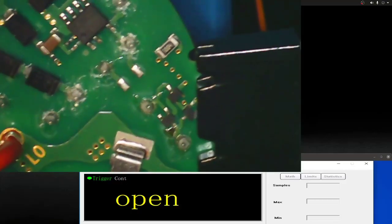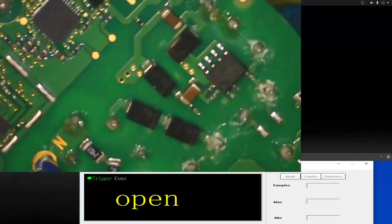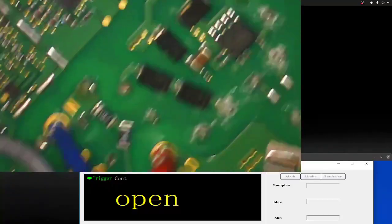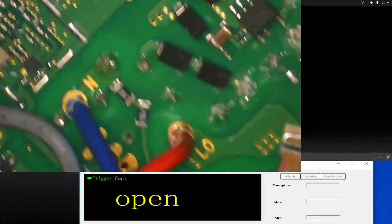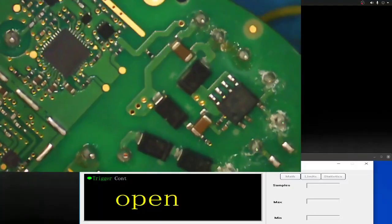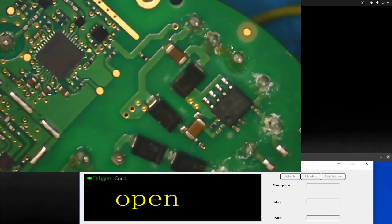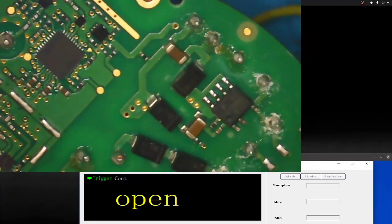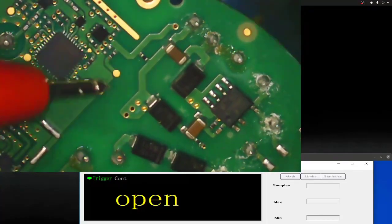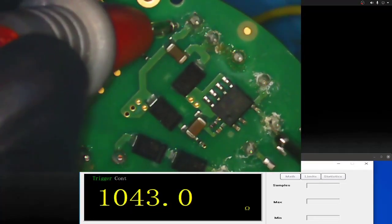Now I'm just going to see if I can, within the shot, get over to the... I can. Oh, that's excellent. Right, so we've got our low voltage side. Now, you can see the separation between the high voltage and the low voltage. And we've got a bridge rectifier there, which goes through. Cool, okay. So just there on the top of the screen, that will be one of the negative rails. I'm just going to see and get on that rail. Might just have to scratch a bit of that conformal coating off. Cool, get on that rail. I'm just going to see if we can.